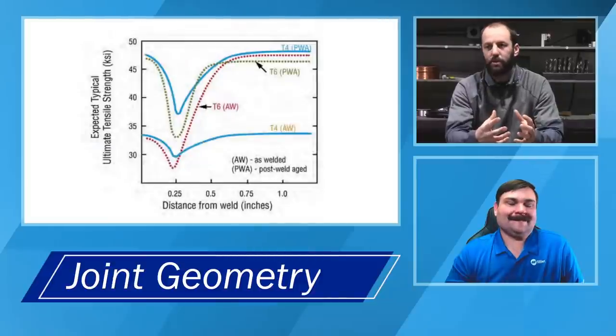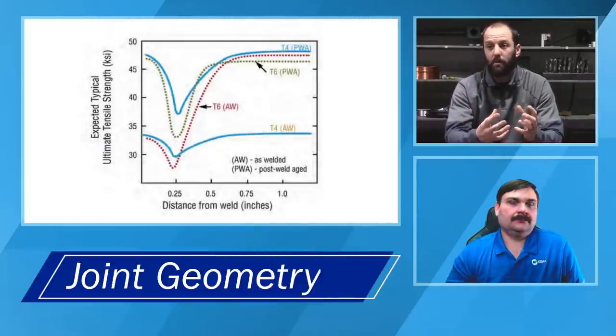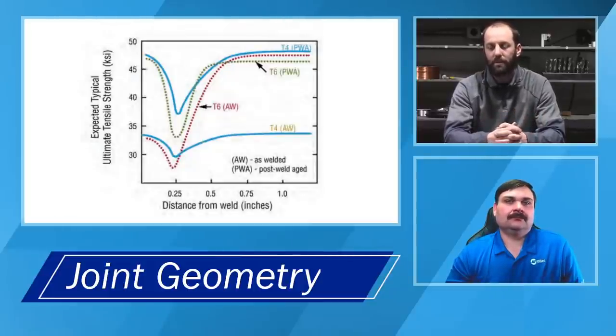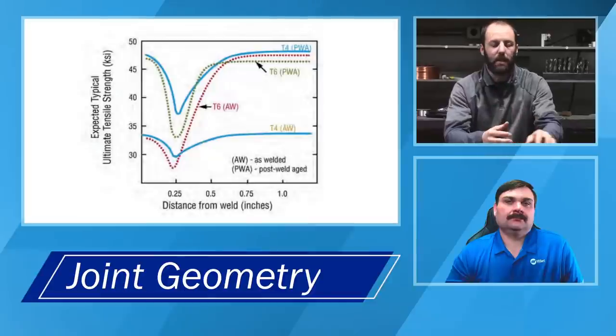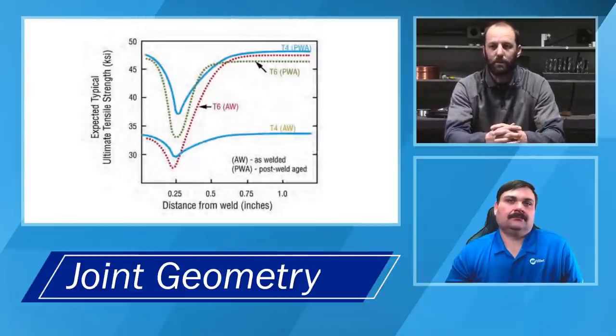When an oxy-fuel torch is burning, it's actually creating water vapor, or a highly humid atmosphere, in that flame from the chemical reaction of the oxygen and the acetylene burning, or propane, whatever it might be. So what's actually happening is that highly humid hot air is hitting that cold base material, and it's actually condensing. It's not coming out of the material. Our flame itself is actually depositing it onto the surface of the material.